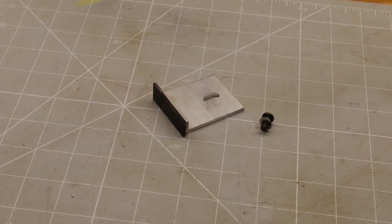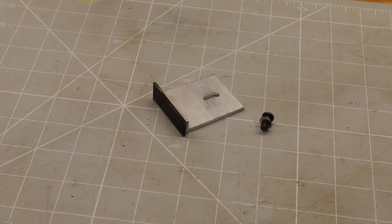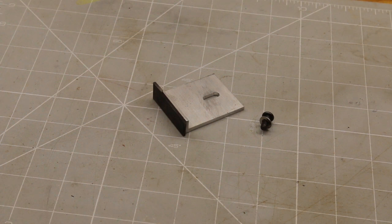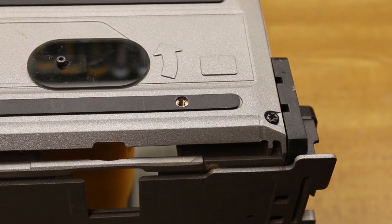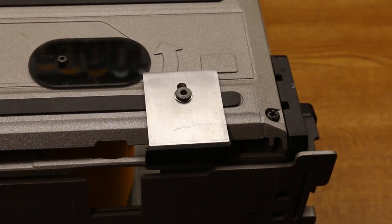A piece of angled aluminium, a piece of rubbing strip, and a 5mm cap bolt. Plus a small 5mm boss fitted through the rubbing strip. This strip acts as a good high friction background to hold the piece firmly in place. It can stay in place for most uses, and after a lot of use, all I have to do is replace the rubbing strip.